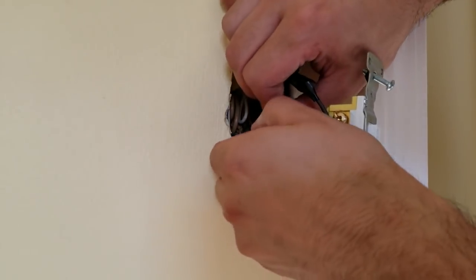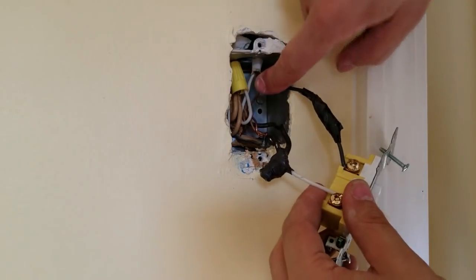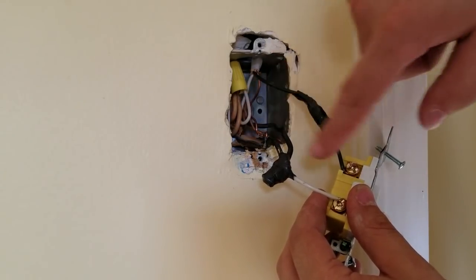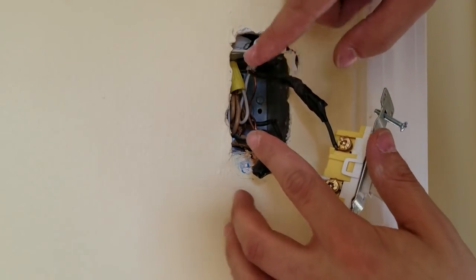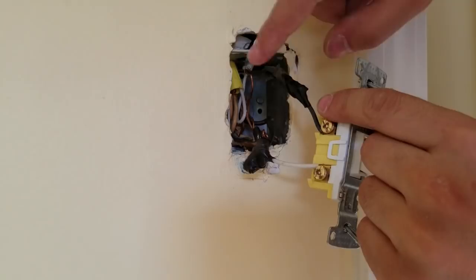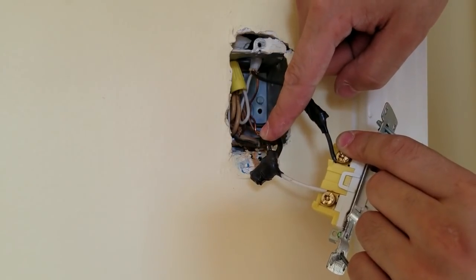So it's gonna be looking like this. So here we got the ceiling coming to the power, and we got the ceiling in the back there hooking up with the white of the ceiling, the white of the power, and the white of the outlets. So all 3 wires are together, as well as all 3 grounds are all together. It's only the power, the hot wire, that is being broken with the switch. And the break is only happening on the ceiling part. These two lines here, these are for the outlet, so the outlet will stay always hot all the time.